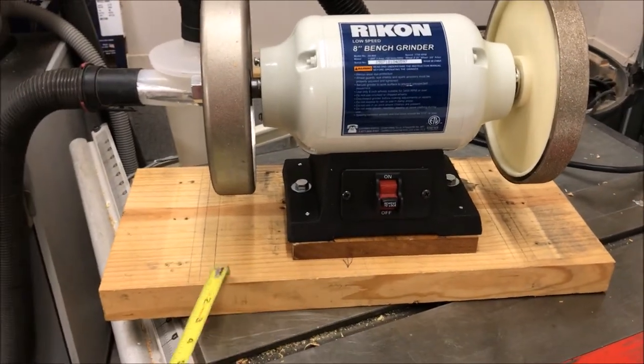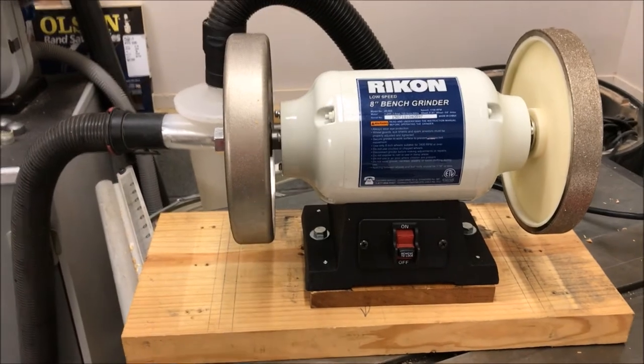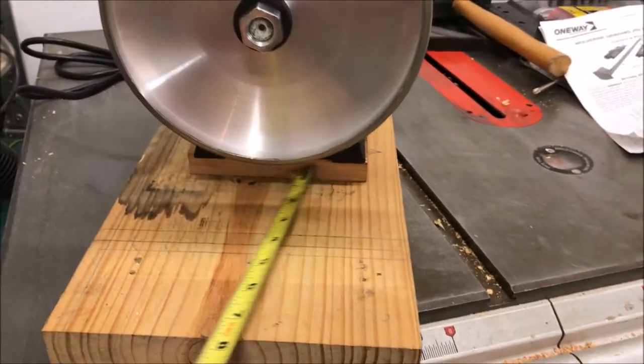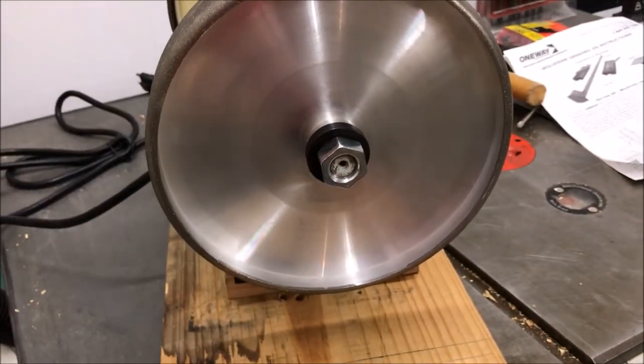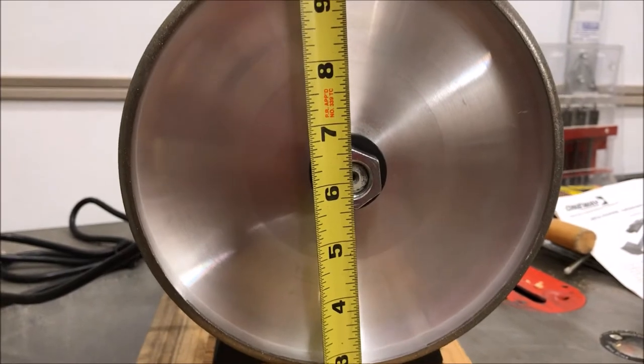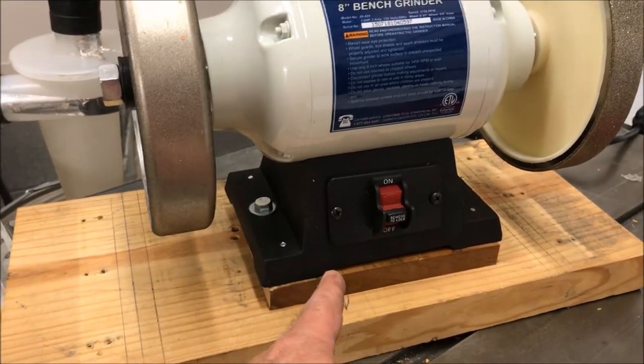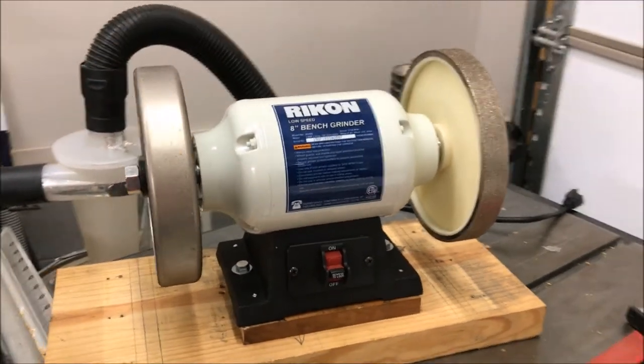I made a little bit of progress on the grinder tonight. I've got the grinder mounted to the board — the same board I used with the old grinding system. I've got both CBN wheels on: the 80-grit for shaping and the 220-grit for putting a nice edge on. When you mount it to the board you'll notice there's a riser block underneath. This center point needs to be six and a quarter to six and a half inches above the block, but I measured wrong — I'm exactly six inches, so I need to add a quarter-inch riser block. I'll just unbolt it, cut a piece of quarter-inch ply, and mount it underneath.